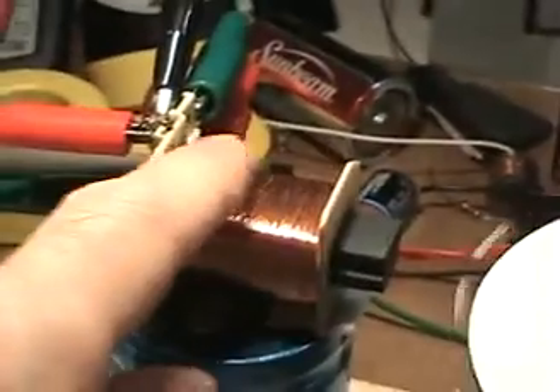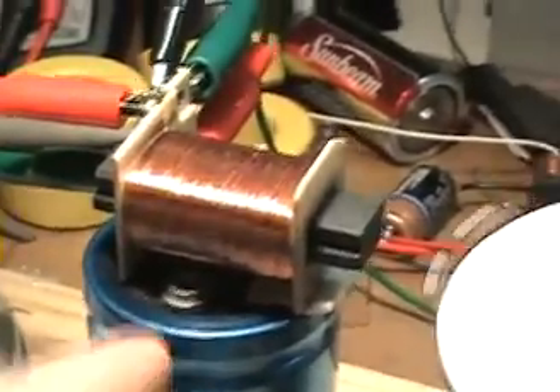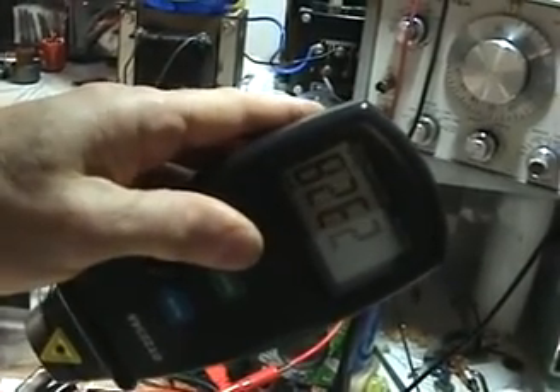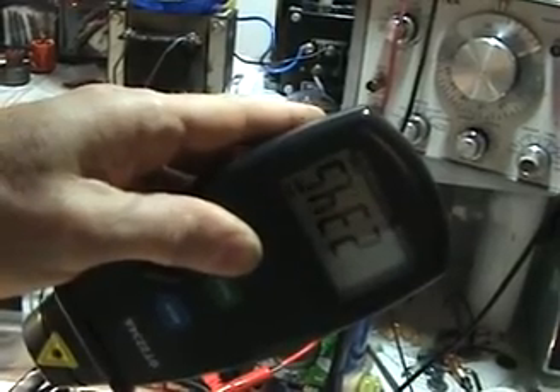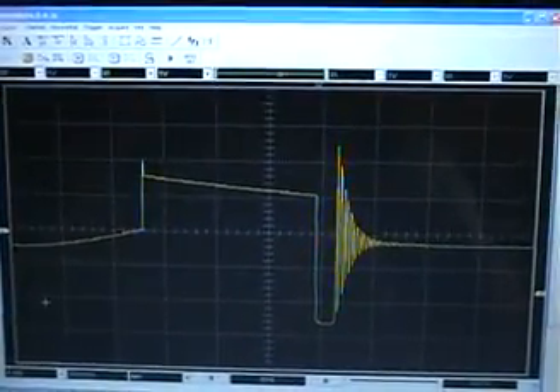As you can see now, the motor is running much more efficiently. This is a coil from a shaded pole motor that I inserted two ferrites into — from one of those little AM radio antennas. So I've got two of those ferrites in there. Looking at our RPM, I was getting somewhere around 235.